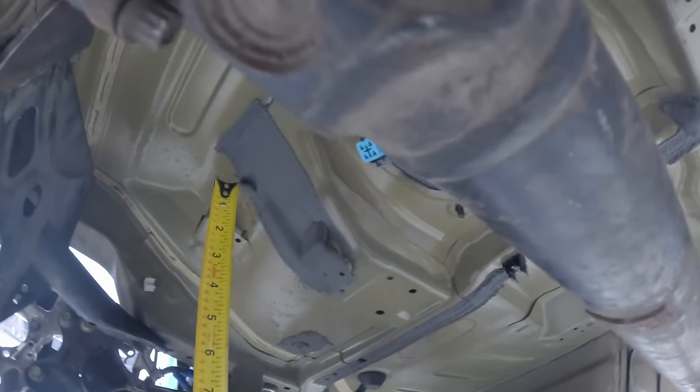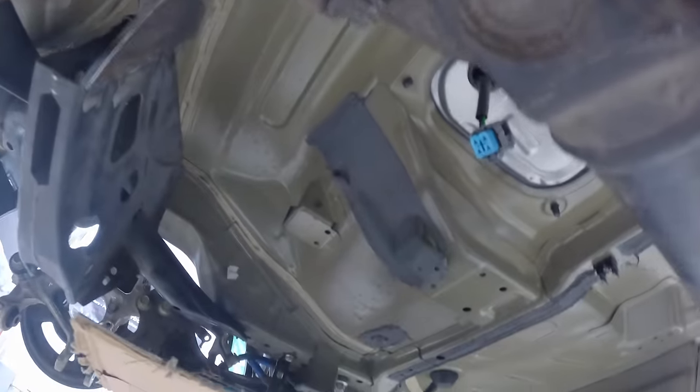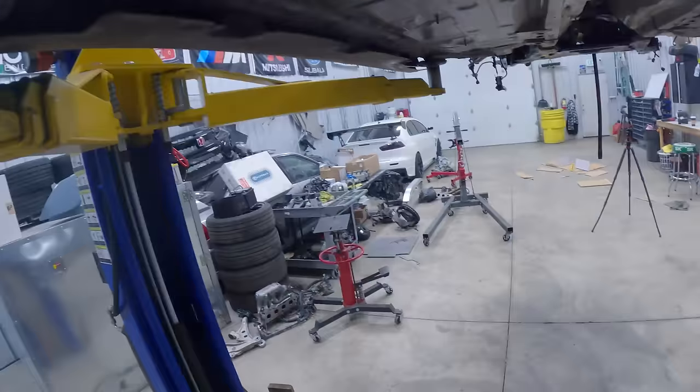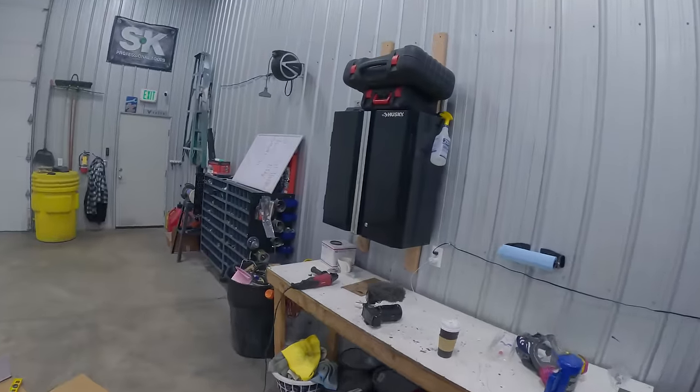They're gonna be 4.5 inches deep all the way from up here to right here, and then it's gonna have to step up to make the space for our fuel hanger and our fuel level sender. Hopefully that makes sense. I'm just gonna start fabbing some stuff up out of cardboard, and then we can trace it onto aluminum, get it cut out, make some bends.